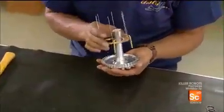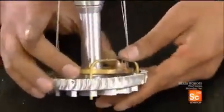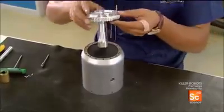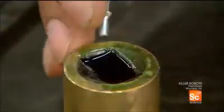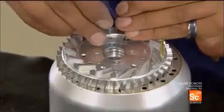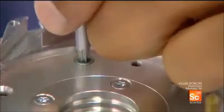He now inserts a hollow cylinder into the base plate, and then presses a fuel distribution ring into the plate. With the parts correctly aligned, he places the assembly in a metal stand. He dips screws in a thread locking compound and drives them into threaded slots in the base plate. This secures and cements the base plate assembly.